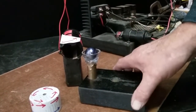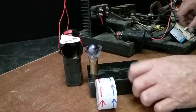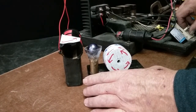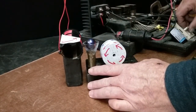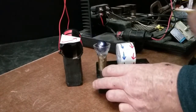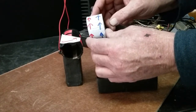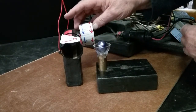When the magnet is at the front end, this is going to be south, so the north is going to want to go this way. When I energize the coil, you'll see the north goes over. When I get to the middle of the coil, the magnet goes with north towards the camera and south away. And when I get to the other end, it goes with south towards the coil - and it does. The reason this happens is that on this side of the coil, the current is always going down. In front it goes down, halfway through it's even on both sides going down so it turns it down, and when it gets over to the other side it's going down - pulling it down that way. That's how that works.